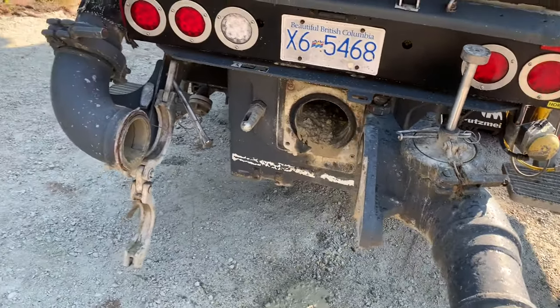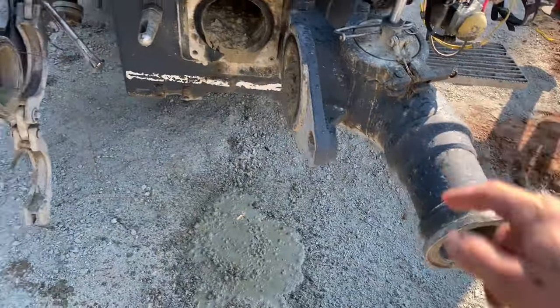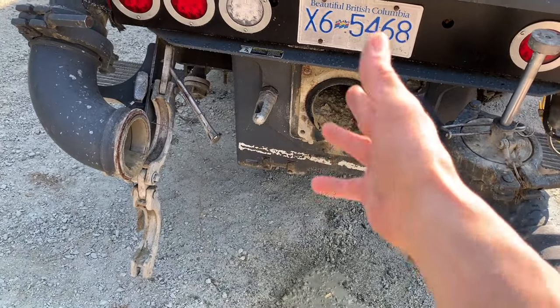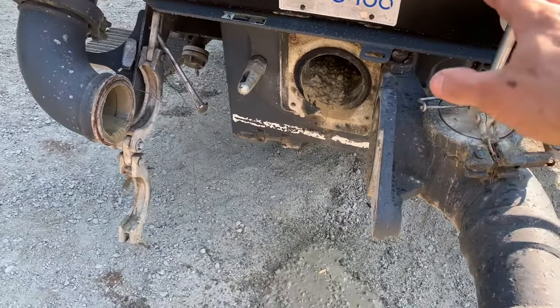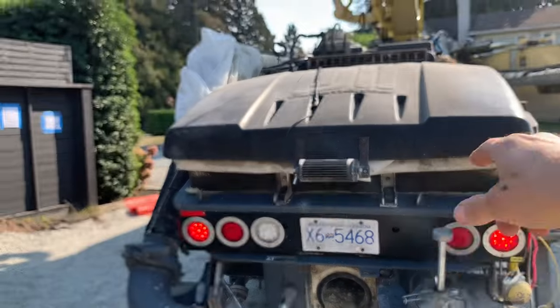The reason I do this, if I go and bust that hopper and drop all the concrete out of it that's in there, then open up the back end only to find my sponge has not come all the way back. But once that hopper is empty, now I don't have nearly as good a vacuum as I do when the hopper is full. So if the hopper is still full and I haven't dropped it, I can just button this back up, wind the pump up in reverse, and most of the time bring the sponge home the rest of that way.